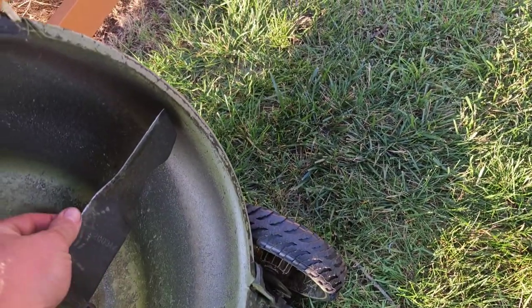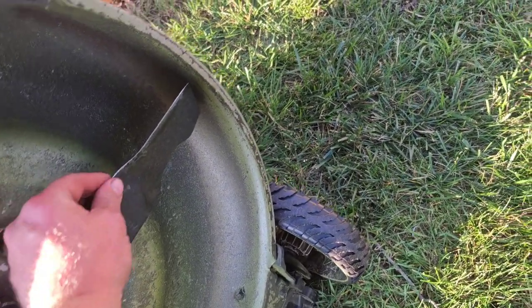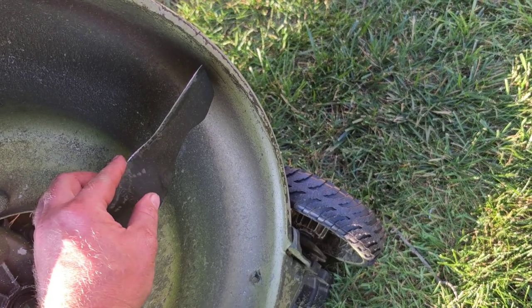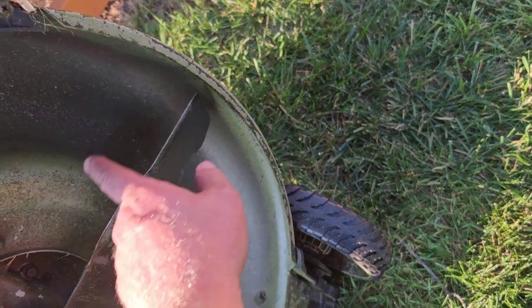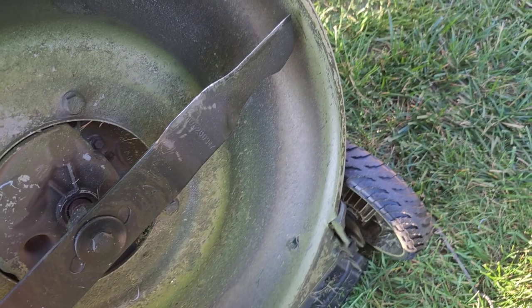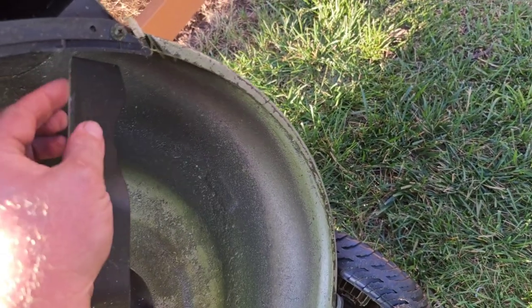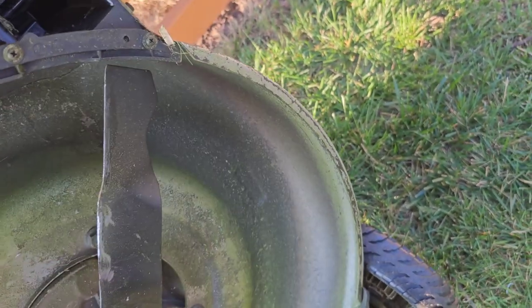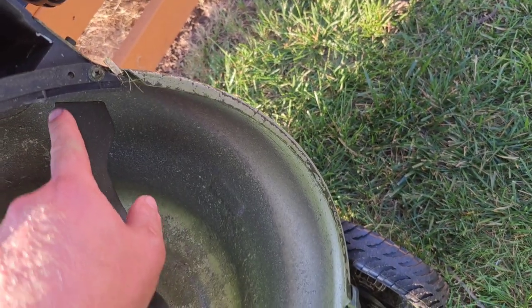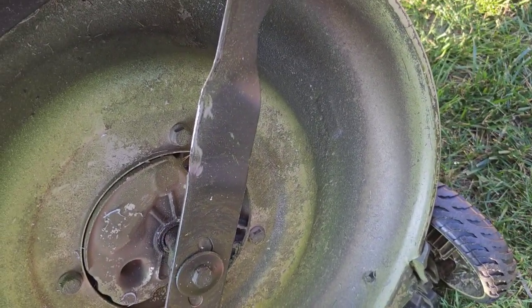I did both sides. I can get all the way to the edge except for that last little piece right there on the end, and it cleaned it up pretty good — all the big nicks and stuff that were in it. It's not super sharp; you don't want it super sharp. You got to be careful because if you start to get it too sharp it'll start to cut into the plastic. As soon as I seen a couple little plastic slivers, I stopped and moved to the next section. It actually worked pretty dang good. It cleaned up all the nicks and heavy spots where I'd hit stuff on the edge. Then I ran it along the bottom just a little bit to get the big chunks — cleaned right up.